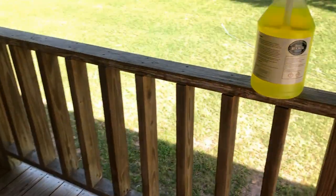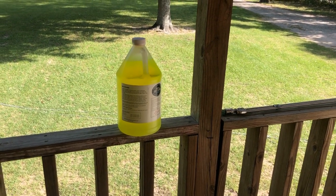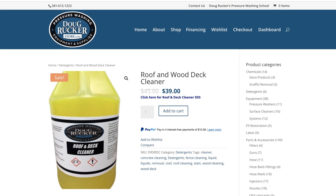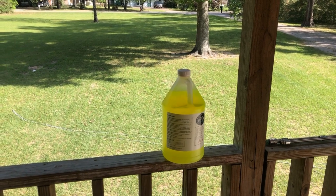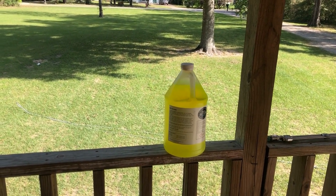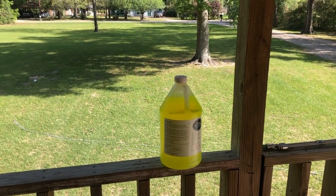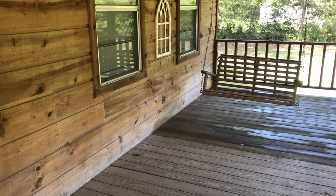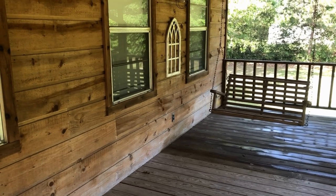The tools I'm using are our roof and deck cleaner. When it says roof, that basically means for wood shakes or any type of wood roof — we use it on decks, we use it on fences, when we're not wanting to use bleach. I'm not a big bleach guy for wood. A 50-50 mix I wouldn't suggest on wood. I use this wood cleaner mostly — it's just easier. I don't have to worry about vegetation or getting splatter on the walls that causes color changes and spotting.